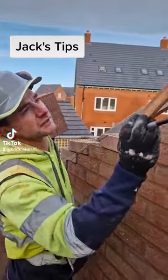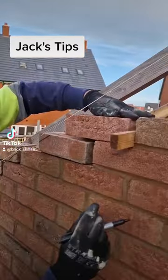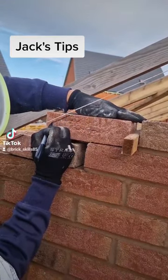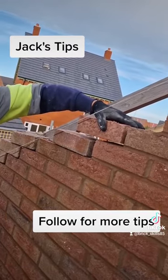When you've got a cut-up like this, you've set them 150 down from the truss, top and bottom. And you want to set it 20mm back from there — that's 20mm — and then come up along that line. Use that as a little gauge, and that'll give you 10mm either side, top and bottom.